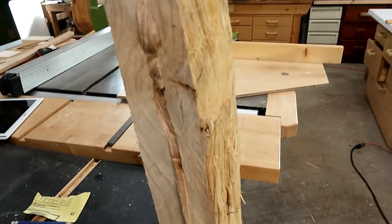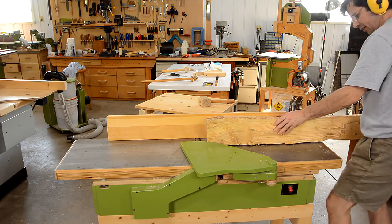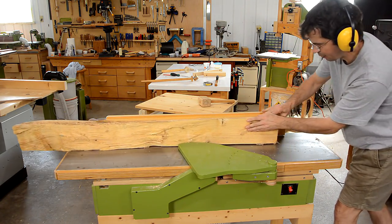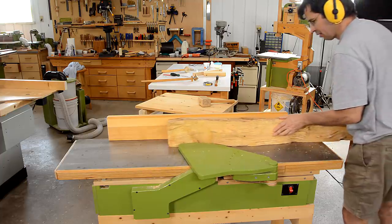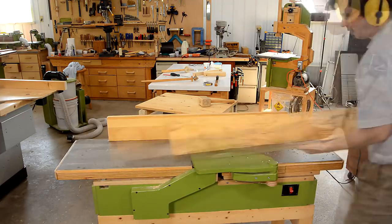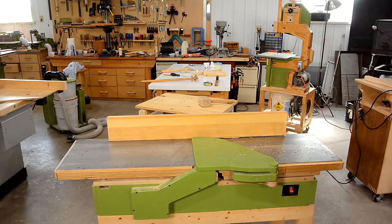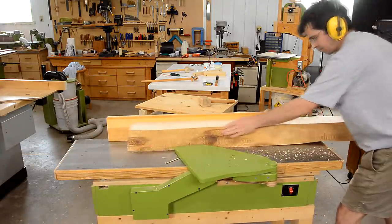That's this one piece of wood which I split and chainsaw milled — it's real heavy and it's real rough. When you start planing down a really rough surface like that, you don't want to be taking down the high spots one millimeter at a time, so you want to set the cut real deep. But suppose you're surface jointing a wide board — say 8 inches or 20 centimeters — taking off one millimeter would already be too much; you'd want to take off less than that to just smooth the surface. So one millimeter is both too little and too much, which is why you need to be able to adjust it and you need that adjustment to be very convenient.